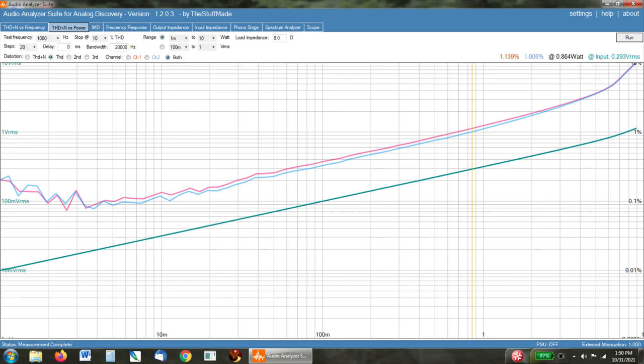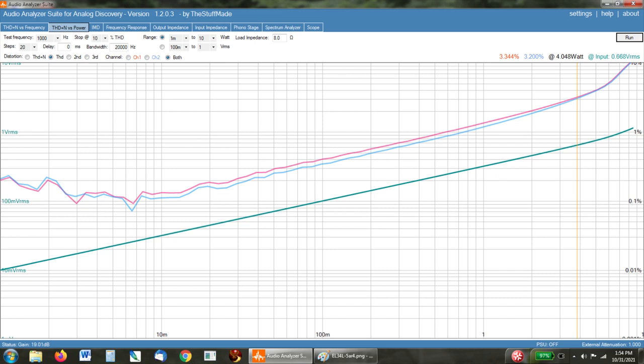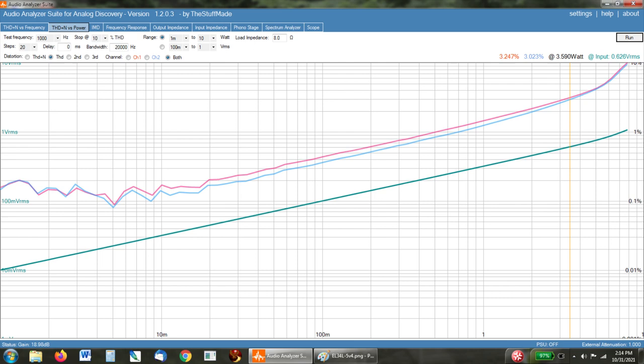Here's the screenshot with the voltage lower. And you can see the curve changes and moves up towards more distortion when we lower the voltage. Then the last screenshot is going to compare the same rectifier tube, but then we're changing to the plain EL34 and not the EL34L. These are both JJ EL34 tubes. The L variant is a little quieter.